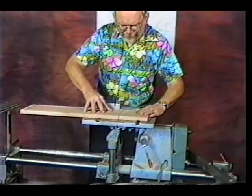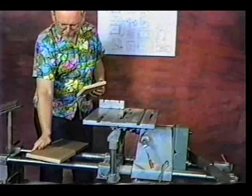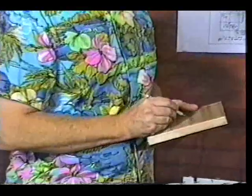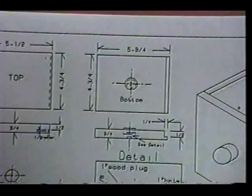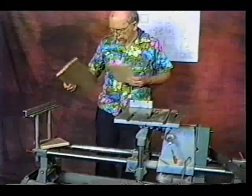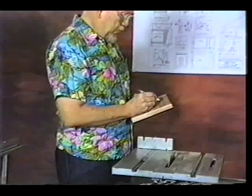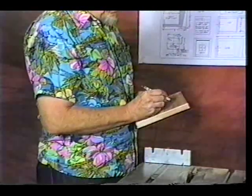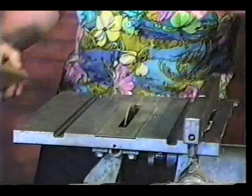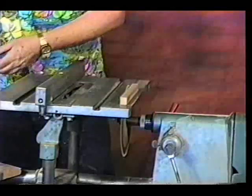There we're making the top piece and again cutting it off. Marking which is going to be the inside of the camera — showing the grain of the wood. Grain should run in the long dimension on the wood. That's the last piece we're cutting out; this is the bottom of the camera. Again marking what is going to be the inside. Now we're cutting off all of the short dimensions because we have an 8-inch piece, so we do have some waste. All the pieces have to be cut to the same size — we just set up the table saw and make the cuts. All pieces are now pretty well roughed out.